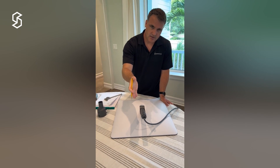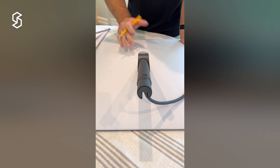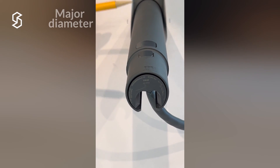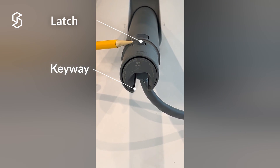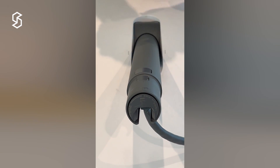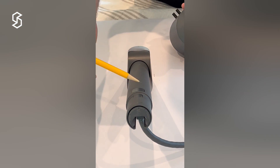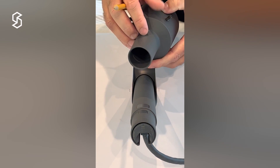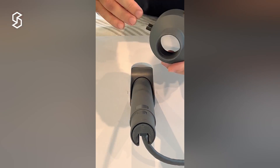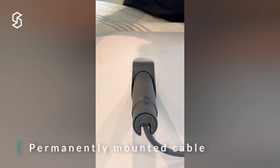Today we want to provide you the dimensions on the pole that's mounted rigidly into the antenna. As you can see, there's the major diameter, there's a minor diameter, there's a keyway, and there's also a latch on the top. The keyway corresponds to the keyway in the middle here, and the latch corresponds to a divot on the opposite side inside of the mating component. There's no reason you couldn't machine something like this, or cut this and weld it to something else, but you want to make sure it interfaces with these dimensions.